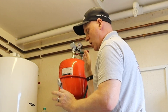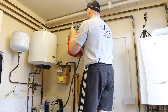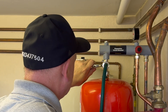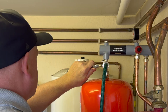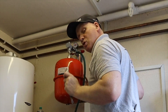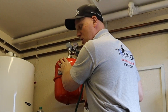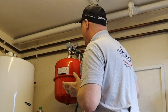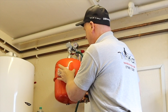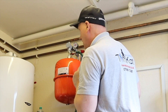I've connected the hose, and luckily there's a kitchen sink right near this vessel so I don't even need to go to a drain. Now I'm going to open this valve with the spanner, which will relieve the pressure off the vessel. I'll leave that open because if we need to put any pressure in, it will force water out of the top and put air in. I don't really like expansion vessels upside down like this as it keeps pressure on the diaphragm all the time, but that's how it's been designed for a compact fit.